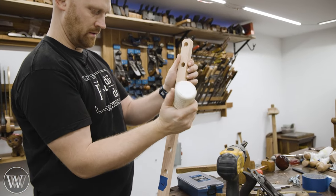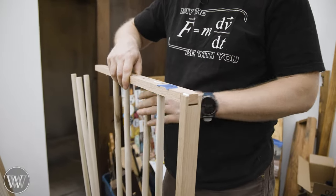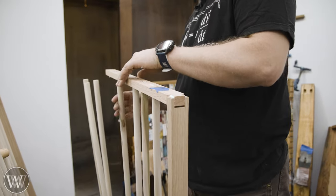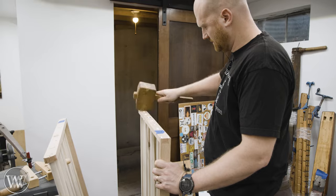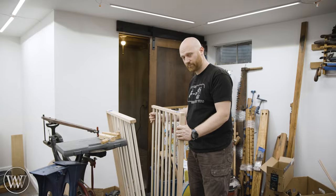I'm using some PVA glue on here. Normally I'd be using epoxy in this case, but I have a bunch of PVA I'd like to use up. So we're going to wiggle these down in here one by one and let the glue drip all over the place. Then you can use your force and pound them down. And just like that, it's done.